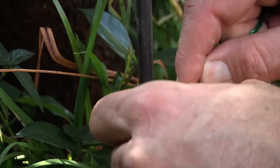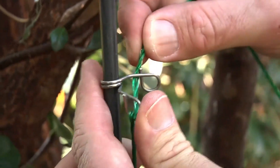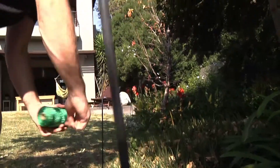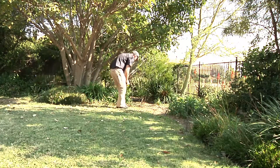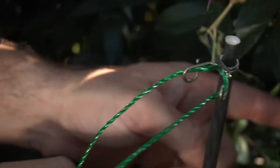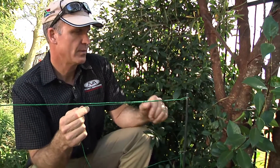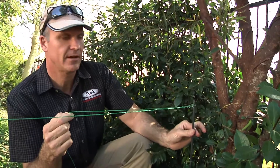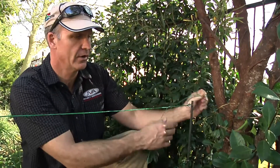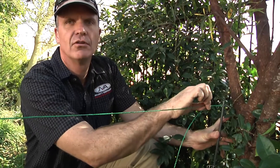At the end point, as I'm doing live wires only, I carry on through and take it up to where I'm starting the next section. Before I cut and tie my polywire, I make sure the whole fence is tensioned up — just a quick walk around making sure it's tense the whole way. At the end of my series fence I knot it off. Sometimes when you put a bit of tension on the post, it could be a good idea to tie it to a tree or something to create a bit of a stay. Remember this is fiberglass — the last thing you want is the wire touching something that will short to ground.